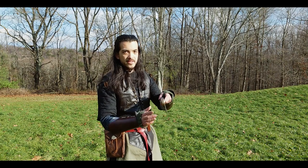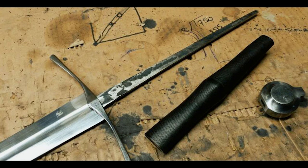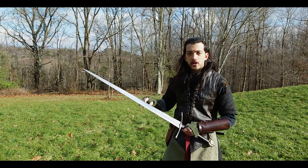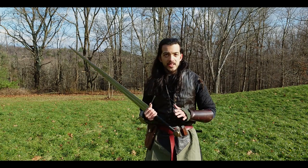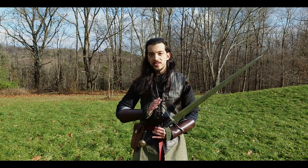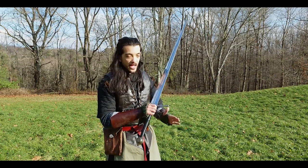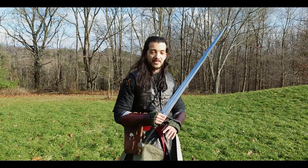I can see from the peen of this that the tang does not look particularly thin, and they also post pictures with each sword on their website showing the sword before it is assembled, so you can see what the tang looks like. This sword is forged out of 5160 carbon steel, and they list the Rockwell hardness of both the edge and the core of the blade on their website. 5160 is supposed to be a much more durable and responsive steel than 1095, though 1095 can hold an edge better. The fittings — the pommel and crossguard — are mild steel, so don't go hitting them into brick walls thinking they'll be completely fine.